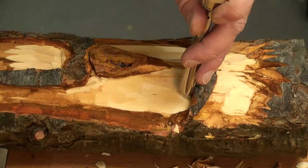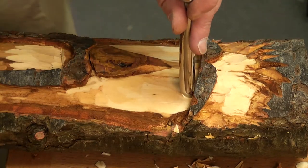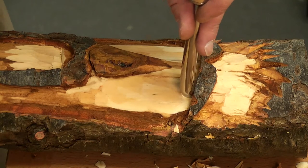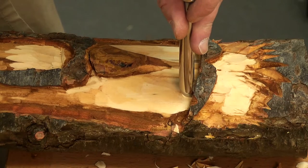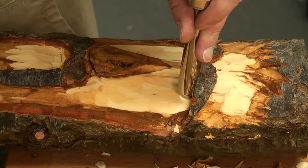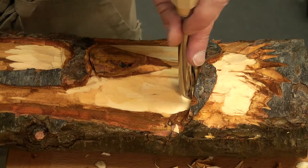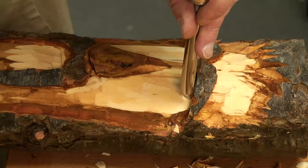Bit stylized. You could carve in your eyes like we've done on some of the others there. I quite like this look at the moment, and it will give me a chance to show you a couple of little techniques. So I'm literally just dropping that chisel, that big wide gouge with that heavy sweep, right down up against his brow. So the wings of the gouge are touching the brow,